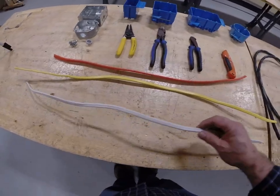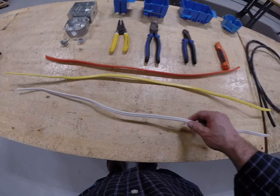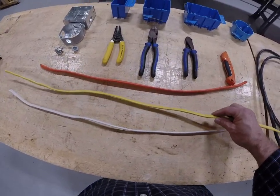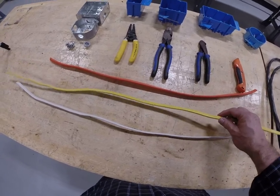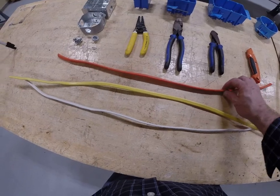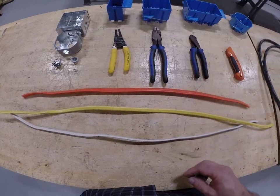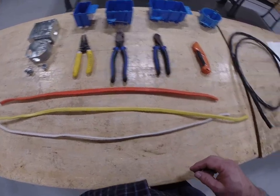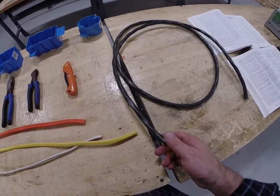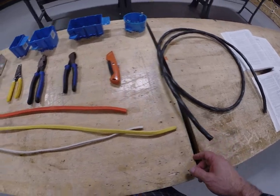Let's describe what we would use each gauge for. Typically, 14-gauge is for smaller circuits — most people use them for lighting circuits. 12-gauge is for small appliance branch circuits, laundry circuit, bathroom circuit, and anything else needing a bigger load on a 20-amp circuit. 10-gauge is typically your dryer circuit or sometimes AC units on a 30-amp circuit. And then 8-gauge is typical for your stove or cooktop — whatever you're cooking on in your kitchen, not gas.